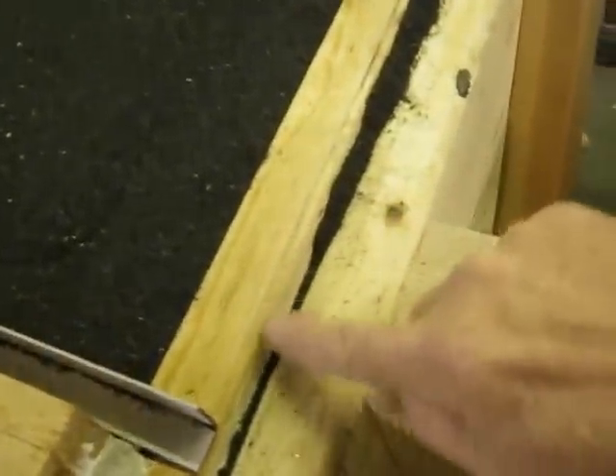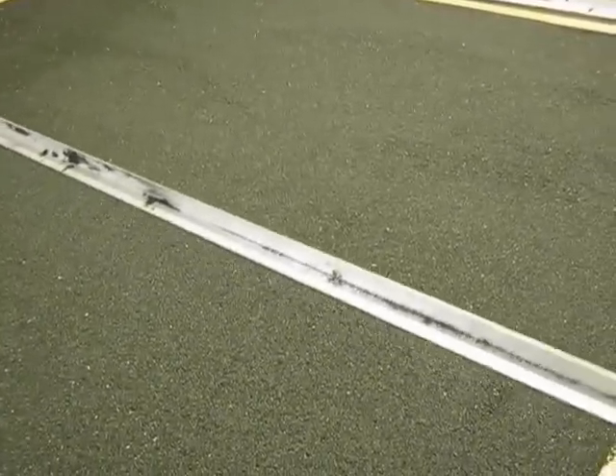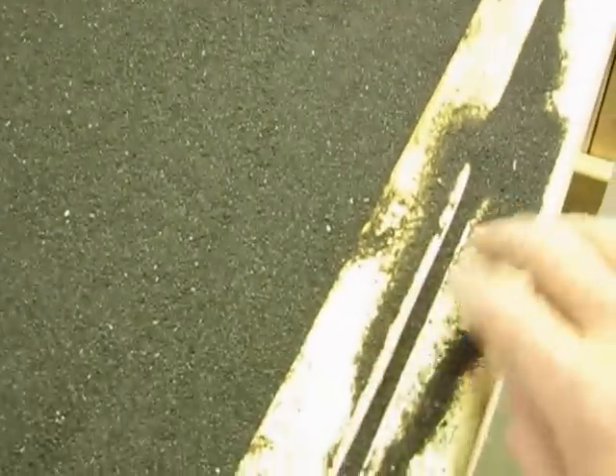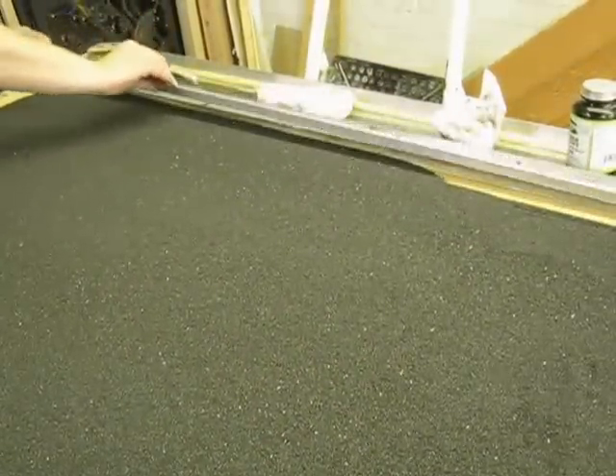This shows leveling off the black granules. We use a long piece of aluminum, and you can see the pieces of wood right here. We're going to end up with the black granules being exactly 7/16ths of an inch deep — that's how thick the piece of molding is that goes around the outside. Then we'll start laying the blocks of glass on top of this bed of sand.